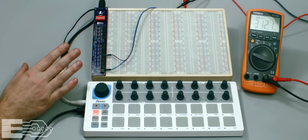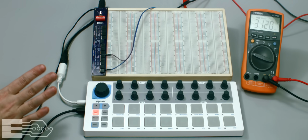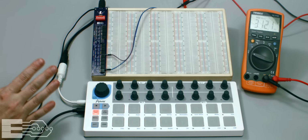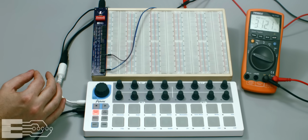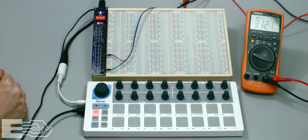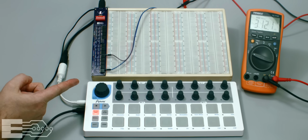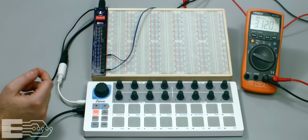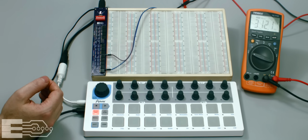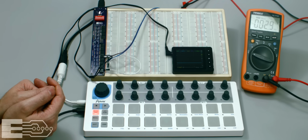This is for the people who want to build an analog synthesizer right on these breadboards. Perfect for that because it's functionality that's all built right in. You don't need an analog shift. You have one built in here. If you need more than one analog voltage, you can just chain analog shifts off of the control voltages or anything you need for controlling your filter roll-offs and stuff like that. But this one's good for controlling your voltage controlled oscillators especially.